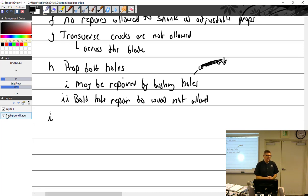Well, the airframe is going to dictate which one, because the airframe has a specific prop. So this guy calls, like, hey, the prop won't fit. I'm like, well, you got the wrong crankshaft. Well, it's a 235 crankshaft. Yeah, well, they make two different versions, and you can't convert that. The fix is you take the crank out and put the right one in. And he goes, well, the prop won't fit. I'm like, no, I know the prop won't fit, it's the wrong crank. Well, what do I do? Do I just drill new holes in the prop? I'm like, oh God, no. And he's dead serious. And I heard a rumor that he actually did that.